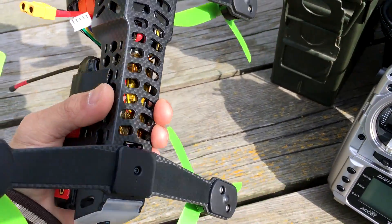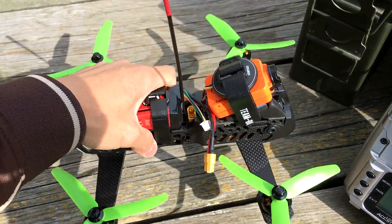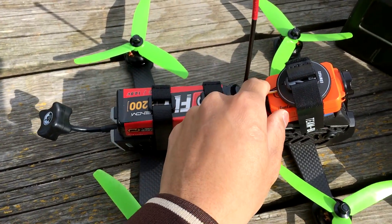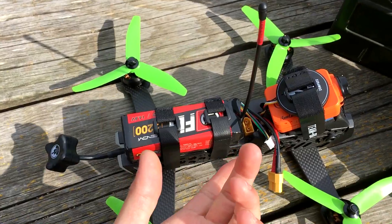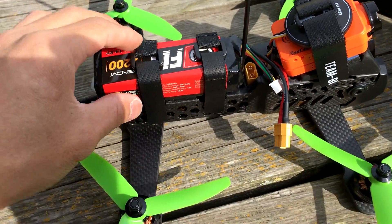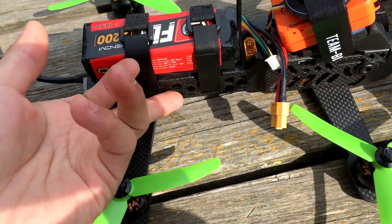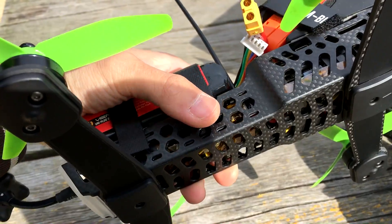I've managed to fit it on with the Core Pro PNP, which is in the back part of this quadcopter right here. What you have to do is add an extra BST cable. You cannot use the splitter, so you have to end up making your own Y harness with the cable, which ends up working out pretty well. You'll end up saving a lot of space. It's just not possible to fit with the splitter since this thing is pretty limited in what it can store — that's kind of the downside.